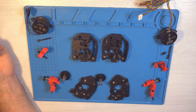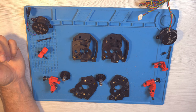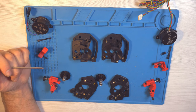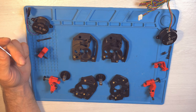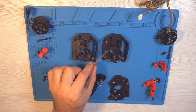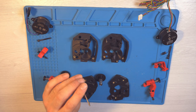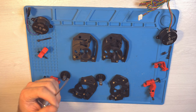So what can I say — did they change something drastically? No. Did they have a lot of small upgrades and modifications? Yes. And should you disassemble your old Clockwork 2 beta to upgrade to the release version? Yes, but only if you're having some extrusion problems or you are printing softer filaments like 70A or 50A TPU. So this is what I have for you today — good luck with your prints, guys. See you later.